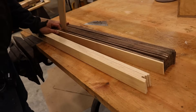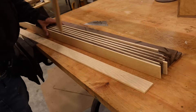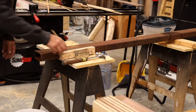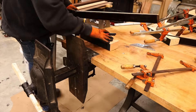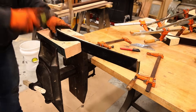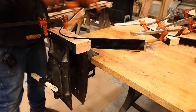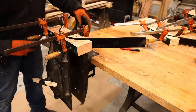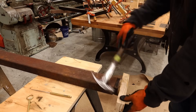Now here I am in the steam bending area. I'm going to laminate the dark color on the back, the light color on the front. Just making sure my count is right. Here's my steam bending tube again — these are all together a little thinner so I don't need to worry. I'm doing four pieces of wood at a time. You can see I'd already done a couple, so I went to school early. Now I'm using my old Prentice Patternmaker's vise to get that initial thing going — it just happened to be the right width — to make sure those pony clamps grab exactly where they need to, just outside the width of the jaws of the vise.